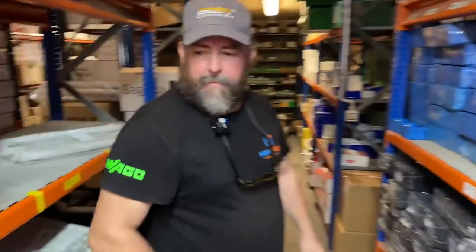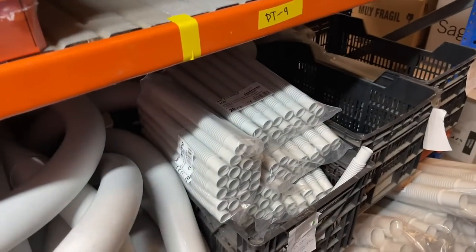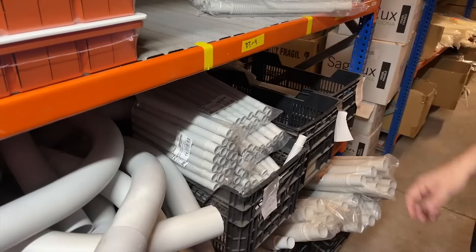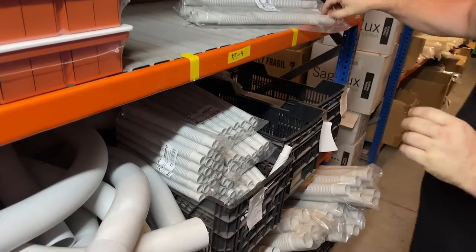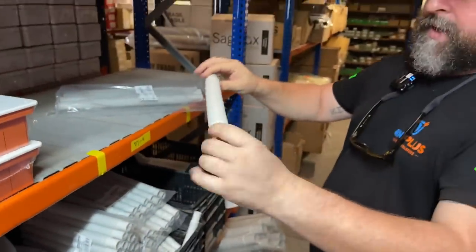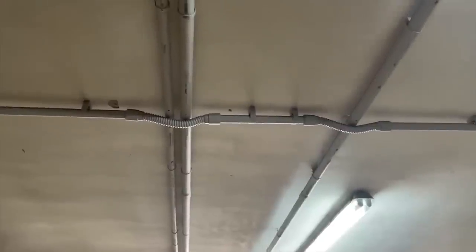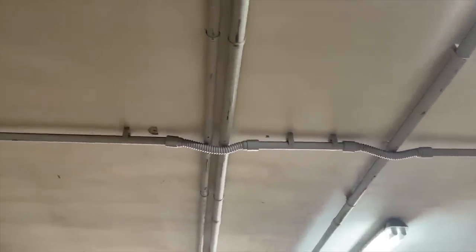Okay. Now, here's something. If you're going to watch one of our videos in the future, you'll see these, because nobody here really bends plastic conduit, do they? No. I mean, certain distributors do sell the springs, but it's all about time. So this is for surface mounted conduit, yes, for 20mm. So the 20mm just slides over the top, or 20mm inside. So if we're in a garage and we wanted to go over something, we wouldn't bend it, we'd just put one of these in. Most people wouldn't bend it.